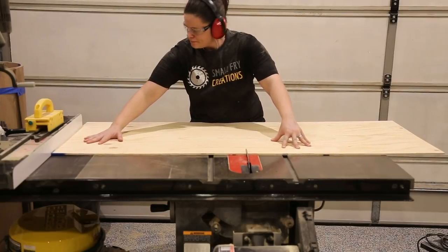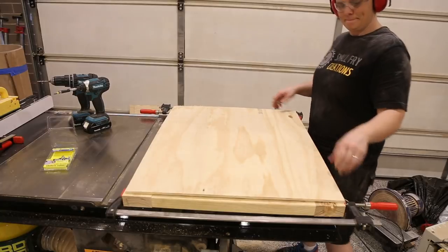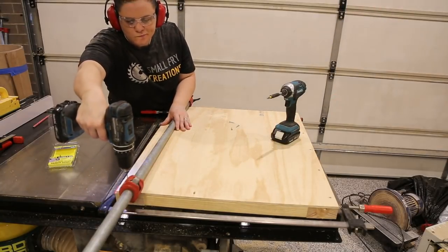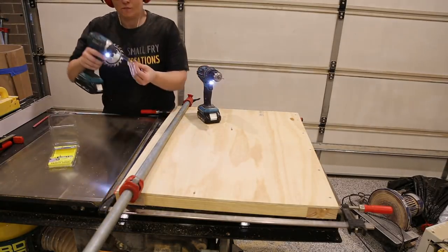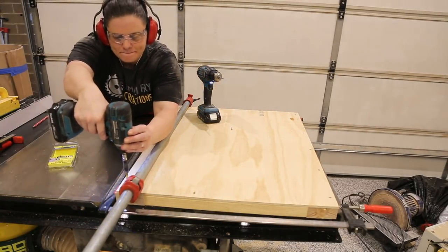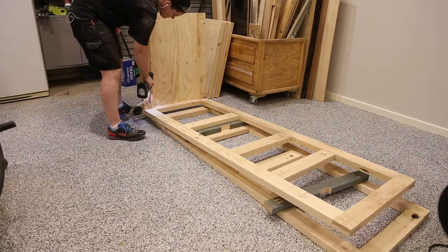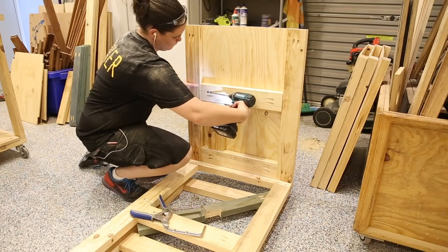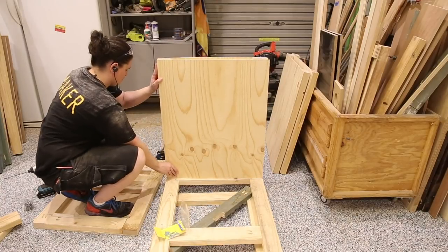To keep costs down I went with a different method for making the panels. I used 2x4s to create a frame and then covered it with 7mm plywood. I just needed to ensure I put blocking in the frame so I had good meat to drill into when attaching things like drawer runners. Covering the frame in plywood also lets me hide the pocket holes, and if I need to make changes later I can just remove the plywood and add blocking. Once I had my first panel with blocking in place I moved on to the next, spacing everything as per my design.